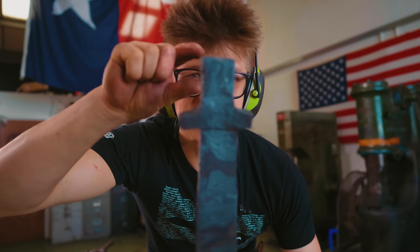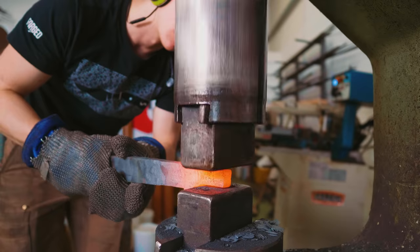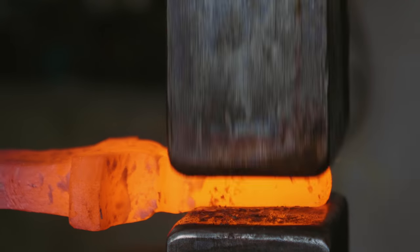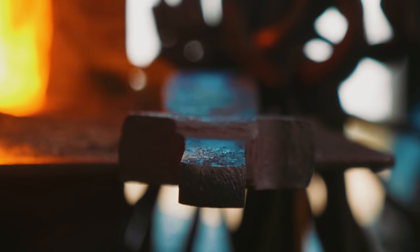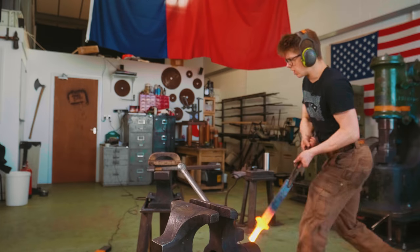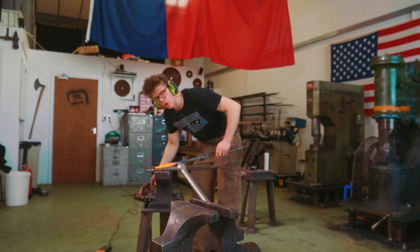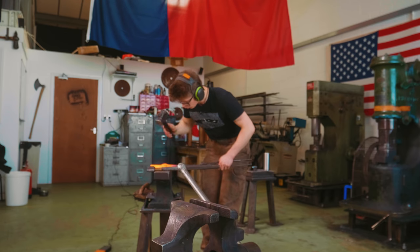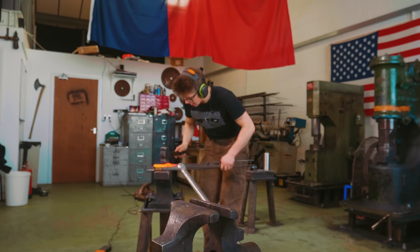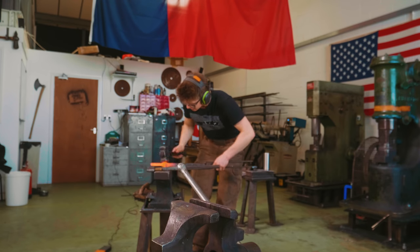We'll see. Now, we're going to take this material here that is our tang, and we're going to break it down and work in some isolations roughly with plenty of clearance material. I'm going to do that under the green hammer. Okay, so I'm just inching my way through here. But something I'm noticing as I broke that down, it looks like it's just a little twisted out of alignment. So, in order to work out if my eyes are deceiving me or if it is twisted, I'm going to try and brush it. Man, it's crusty. Taking so much time, the scale is crusty. And I'm going to work my reference surfaces here at the guard. You know, I'm trying to make something that's nice and neat and square and straight. And so I've got to have good baselines to work off of. I've got to have good reference planes that I'm referencing.